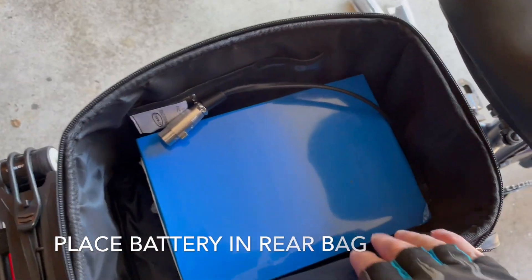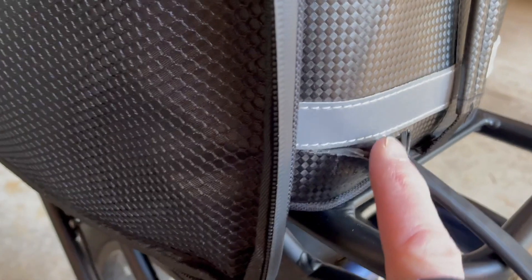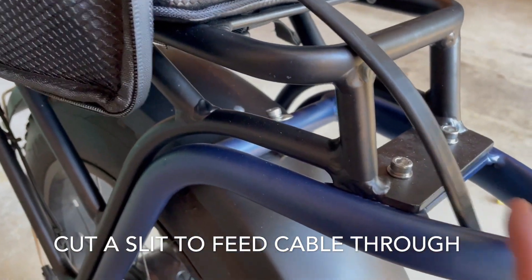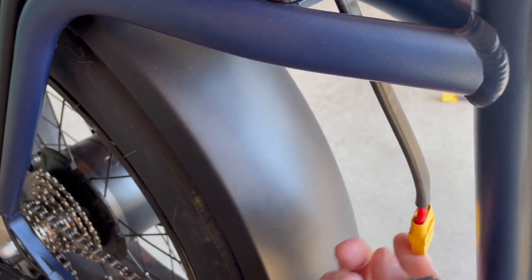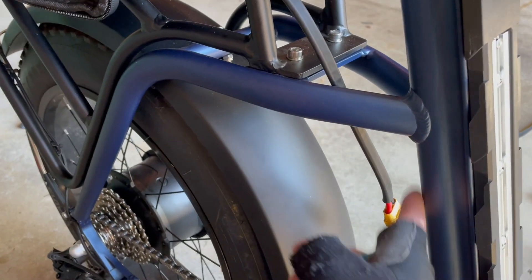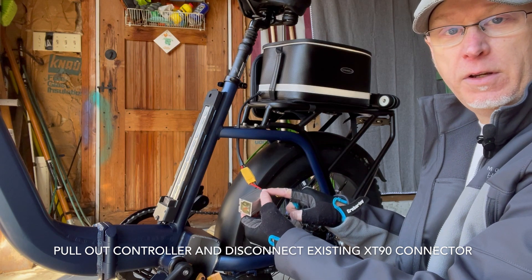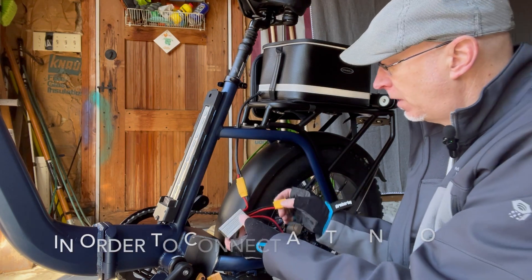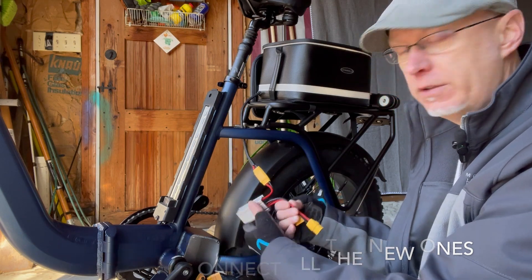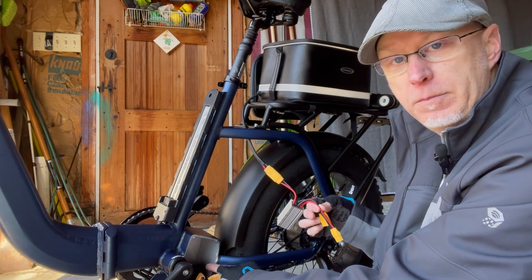I've put the battery inside the case. A slit is cut into the side right here, and the cable comes down through the bottom. I'm going to attach one of the extension cords to this so that it can reach the control box, and I have room to place it somewhere along here once I figure out where exactly I want to mount it. The new battery is now connected to the dual battery parallel connector. Now we're going to connect the other two wires into the control box down here through the hole in the control box piece.